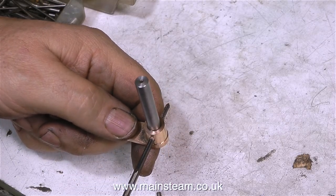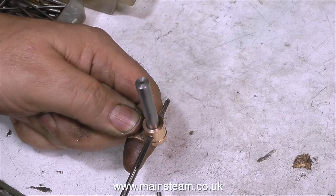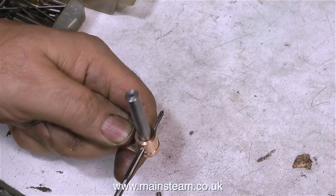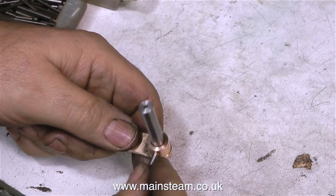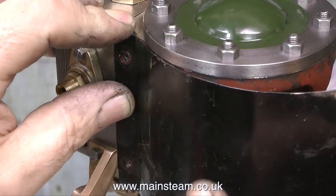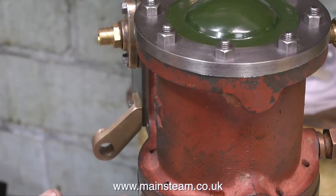Guiding a taper reamer through a hole like this to make a tapered hole feels quite good under the fingers, and I've got to be careful I don't overdo it. But I got it right in this instance. When I fitted the pin, there was an equal amount protruding at both ends. And flush with success from the taper reaming session, I'm having a quick look at the cylinder cladding.